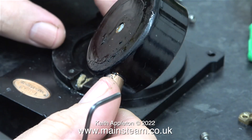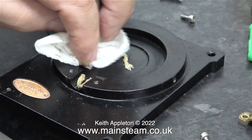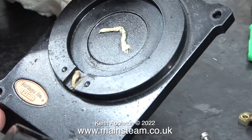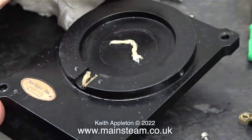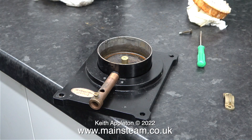The burner is held to the base plate with this clamp, which I've just removed. And here's a nice touch — two pieces of string to stop it rattling about or resonating. That's a simple yet clever idea. Ceramic burners do suffer a little bit with howling; this generates a resonant frequency which isn't helped by the fire tubes and the chimney.